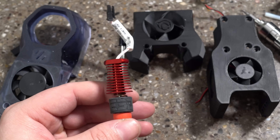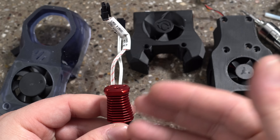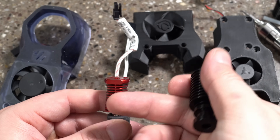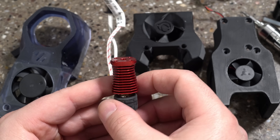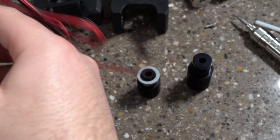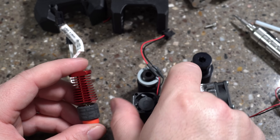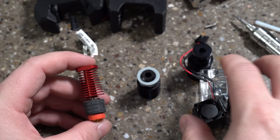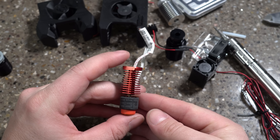It is the Revo Voron, but you don't have to install it in a Voron — it is compatible with any printer you wish to design a mount for. There's been a growing shift toward rigid mounting heatsinks versus methods like the groove mount, so many people will likely want to design Revo Voron compatible mounts. One important note: unlike the Revo 6 and Revo Micro, the Revo Voron does not come with a fan, so you will need a mount with heatsink cooling built in.